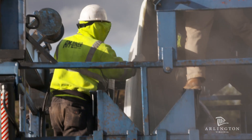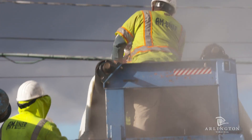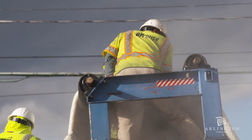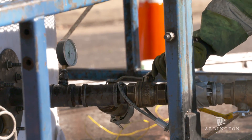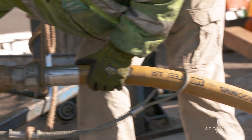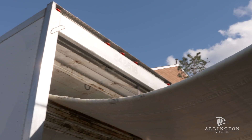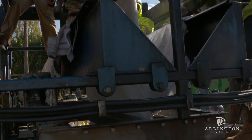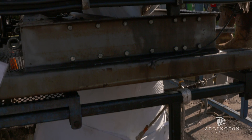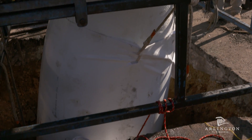This will be a cured-in-place pipe, and all we have to do is open up each of the manholes along the way and invert the pipe within the existing pipe. The cured-in-place pipe is a polyester fiberglass-type bag that is impregnated with a resin that, once cooked, will form a hard plastic liner for sanitary sewer and storm sewer pipe.